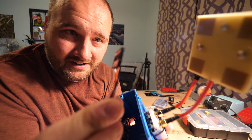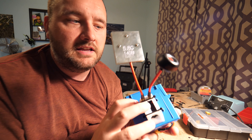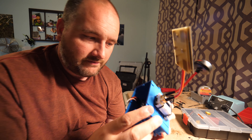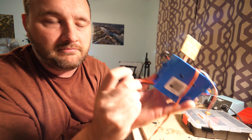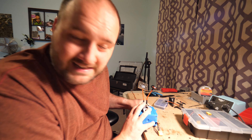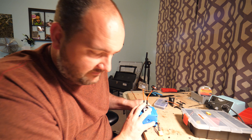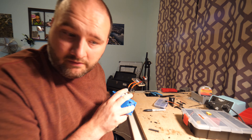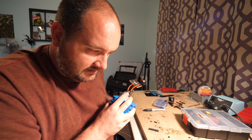On the front here is my diversity receiver — even my 3D-printed plate cover from my goggles. I dremeled out a little hole and I've got a connector back there plugged into it that I found in my box of wires and repurposed. I only needed three pins from it: power, ground, and video. I found out this receiver actually runs off 5 volts, so I needed 12 volts and 5 volts. What I did is I took an old power distribution board, got it soldered up with a pigtail, and it worked great.